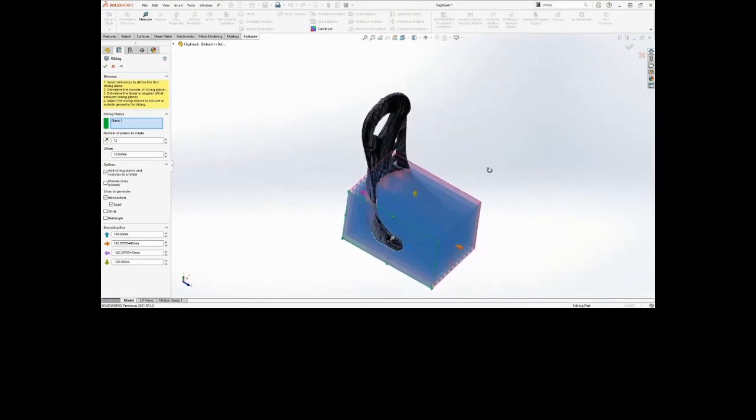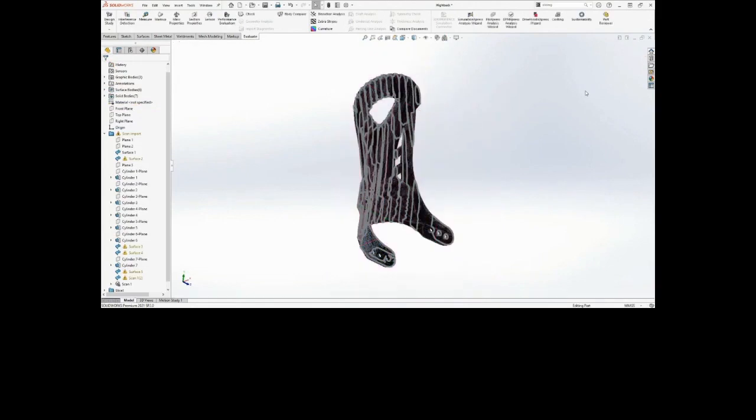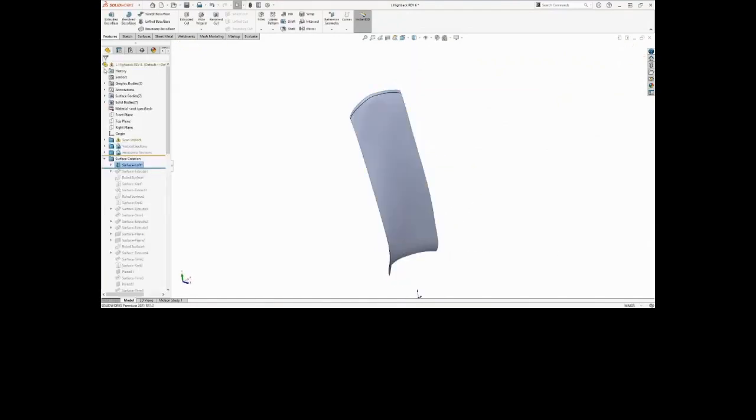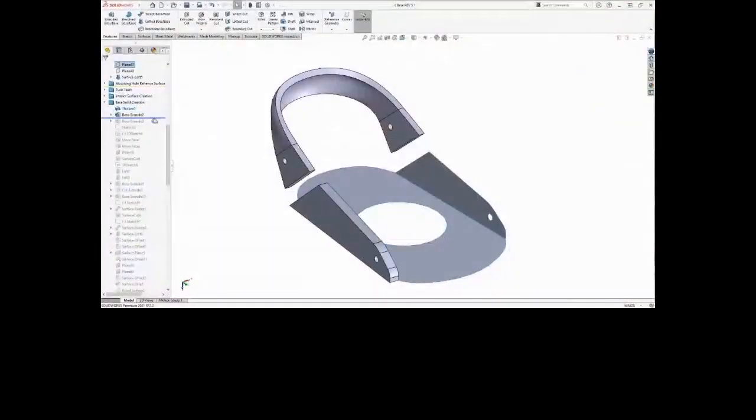Once the offset for the planes is entered, SolidWorks automatically creates 2D sketches at the intersection of the source geometry and the reference plane, giving us slices of the critical geometry to reference. Once the sketches are created and cleaned up, smooth parametric geometry can quickly be generated using the surface loft tool between each sketch section. With SolidWorks surface modeling, we can loft between slices, trim away sections with the trim tool, and merge bodies with the knit tool. In little time the scan data was converted, the bindings were modeled, and our prototype was ready to be made.